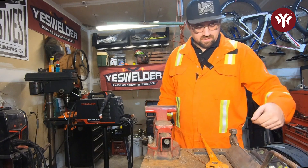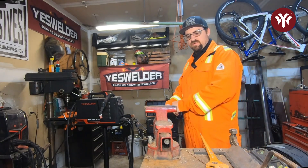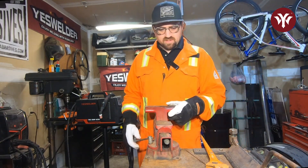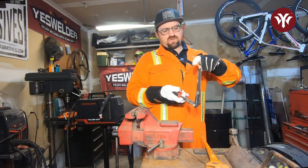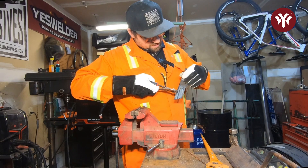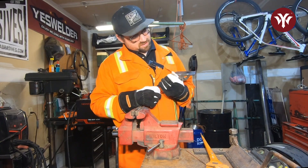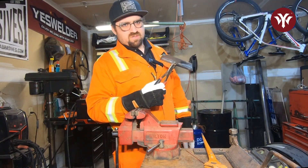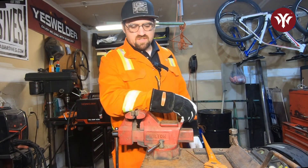As you can tell, there's quite a difference between the two. Welding on dirty metal might look good — it might look like you get away with it. But then you break that weld apart, and the strength and clarity of the weld make it quite clear which one is stronger. The dirty one — I didn't have to bend the metal in order to get it to break, and there was all sorts of porosity, lack of fusion, and all sorts of other things. This clean one ended up being nice. I didn't see any lack of fusion, absolutely zero porosity, and the same size weld was strong enough to bend the metal when I went to break it — telling me a clear difference in tensile and shear strength.